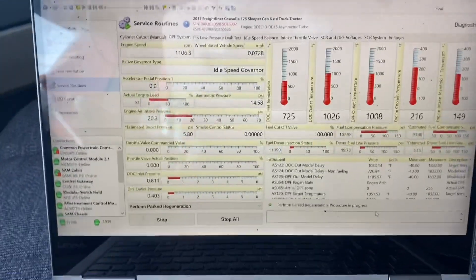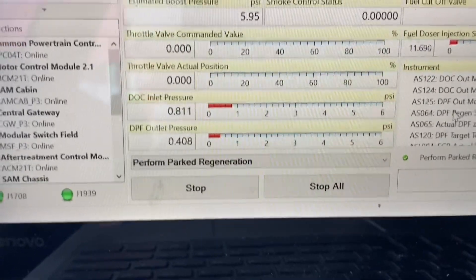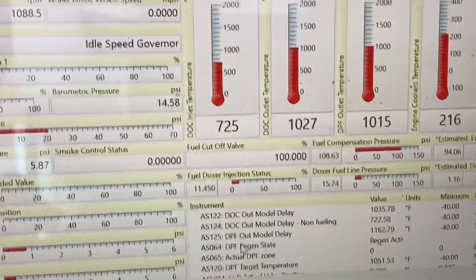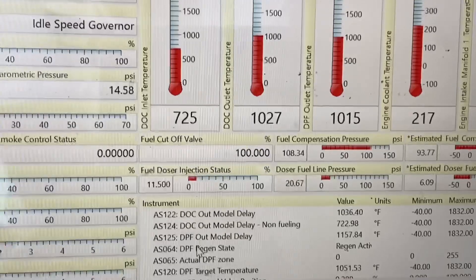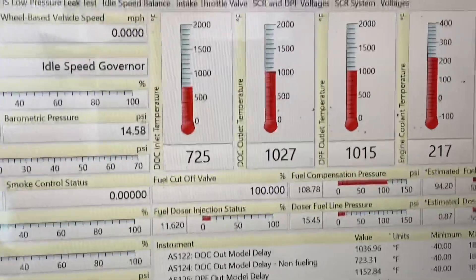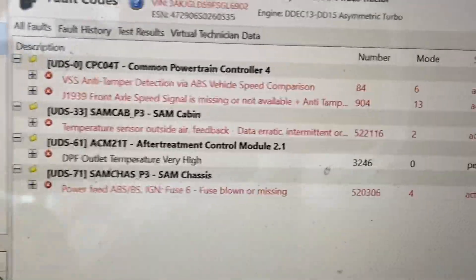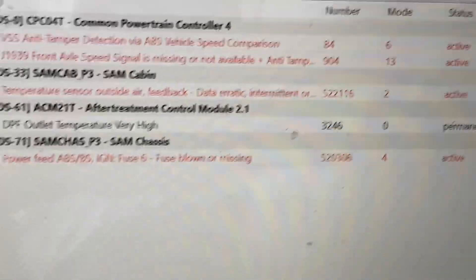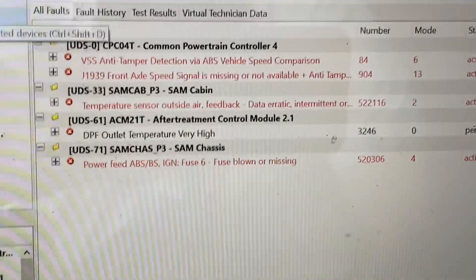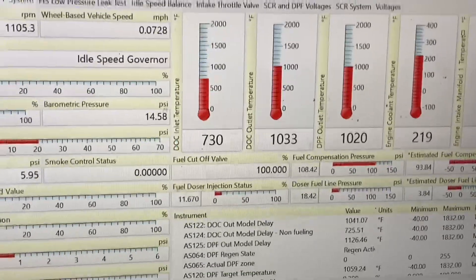Here we are about 20 to maybe closer to 25 minutes now at this point. DOC inlet pressure is really good — it's actually dropping a little bit, which is okay. Our temperatures: DOC inlet 700, and the last two, 1,000 and 1,000 — those are going to stay pretty close to each other. We're still dosing fuel, which is good. I don't see the fault code. Let me go back to the fault codes — this has some other fault codes, completely unrelated to what we're looking at. In this case we're looking at fault code 3246 FMI 0, which is DPF outlet temp very high. Right now we're still within the limits, which is actually really good. I'm really pleased with the way this is turning out — it looks like so far, so good.